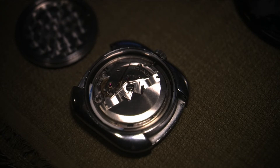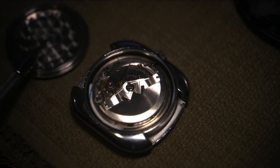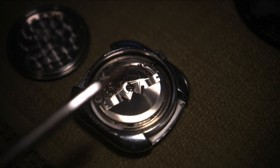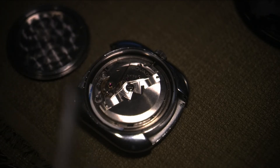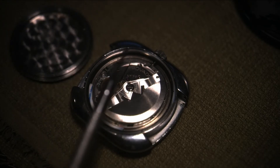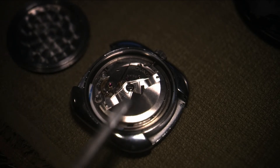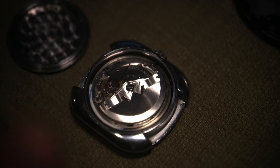Once you get it right, you've got to really tighten those two screws that hold the face on. The date wheel is really, really sensitive on these watches — the frame can touch the date wheel, and pressure on the case can push the date wheel. That's why you want to isolate everything from the back of the case, so nothing moves the date wheel and it can work properly.